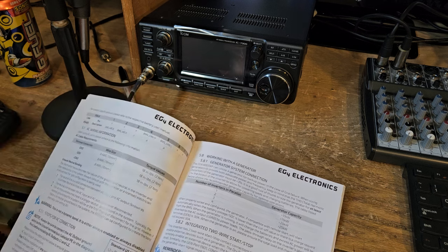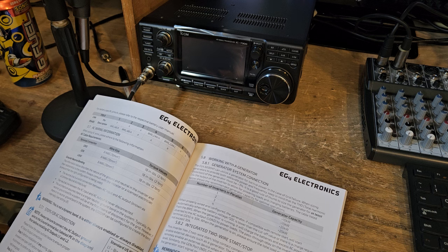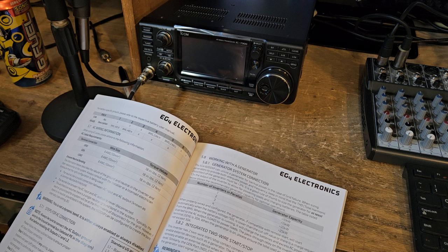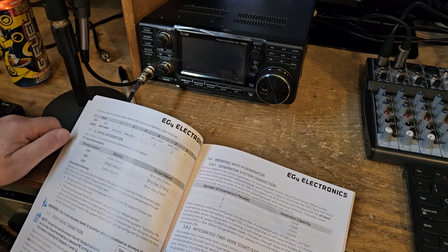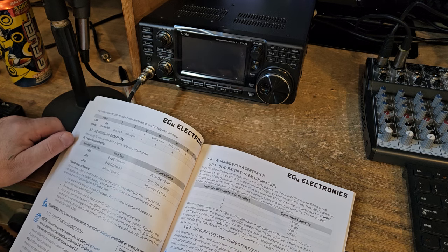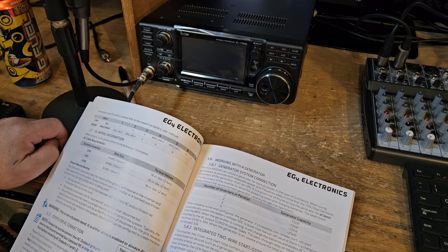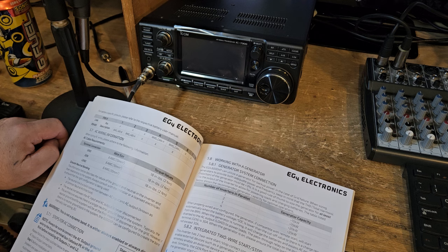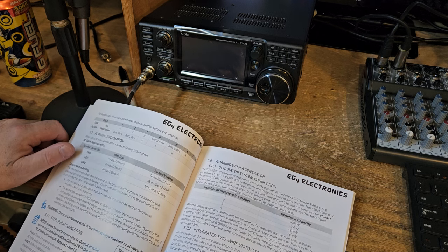Okay. Let's see. Always be sure to connect the AC output ground wire to the ground terminal bus. The information below describes the nature of the ground and the neutral in the inverter and their relationship to the system. The neutral line is a solid connection between the AC input and AC output, known as common neutral architecture. The neutral line between the AC input and output is never disconnected. This architecture assumes there is a single neutral ground bond in the system. Typically, the neutral ground bond for the system will be at the first means of disconnect from the grid, so your panel. However, if there is no neutral ground bond in the system, the inverter can be configured to create the bond internally.